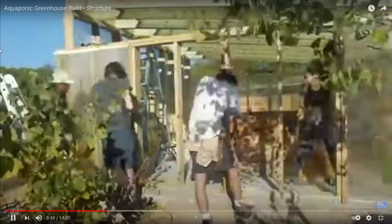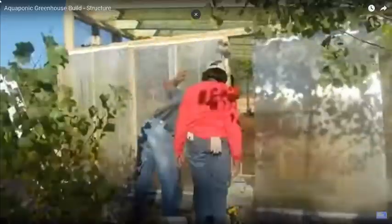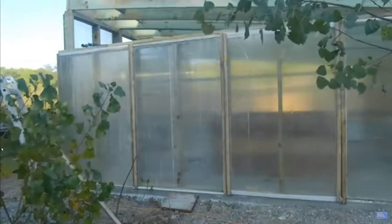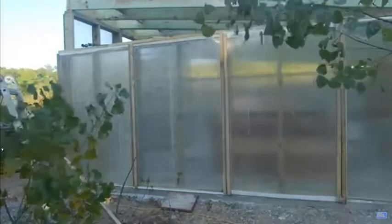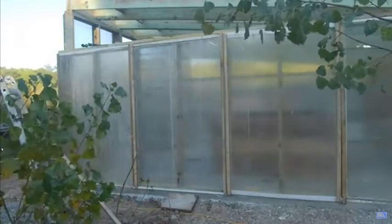They also make translucent polyethylene double-wall panels, just like polycarbonate — that's another option. We actually used that on the very first greenhouse, on the front side, with polycarbonate on the top sides. The first time around for greenhouse number one — the one now used as storage — we had the whole polycarbonate panel slide, so we put like a rail instead of battens. But over time, after three or four years, the winds just blew it off.